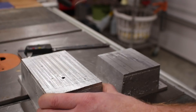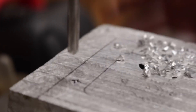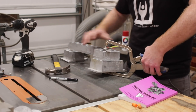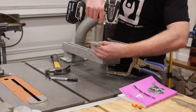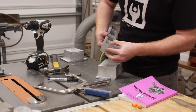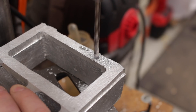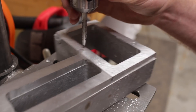With the bed mounting locations marked on the feet, I moved to the drill press to drill holes in the feet. You might notice that the tops of the feet castings have been machined. I believe that Bob did some machining on these parts in his mill before sending them to me, but it certainly isn't required. If the castings were rough, I would have flattened them over at the surface plate the same way I did the bed. After clamping the feet to the bed, I was able to transfer one of the five millimeter hole locations to the bottom of the bed using a handheld drill. I used a five millimeter drill bit for the locating holes. Returning to the drill press, I completed the hole and tapped it for a six millimeter fastener.